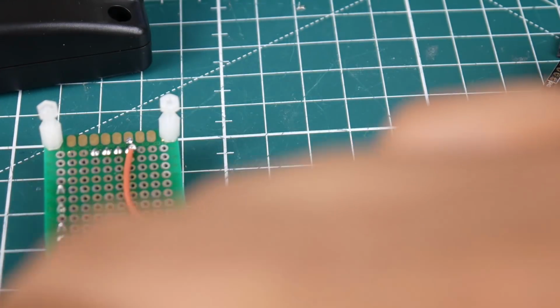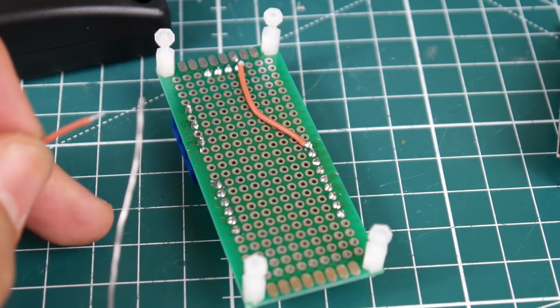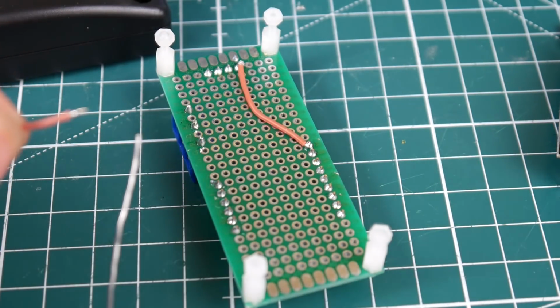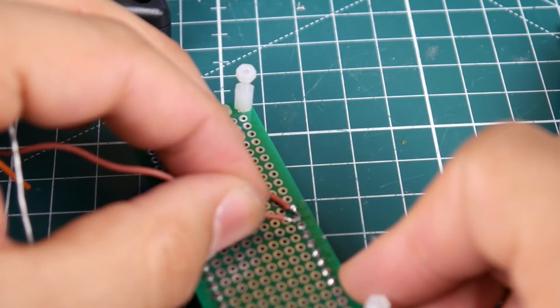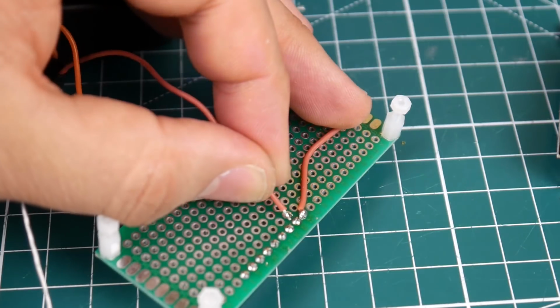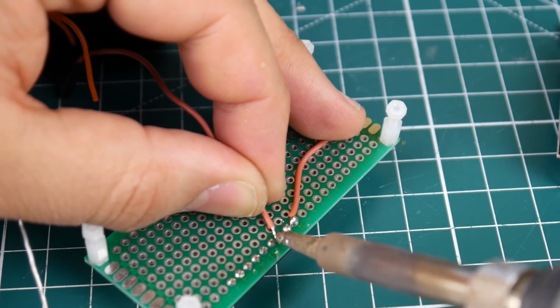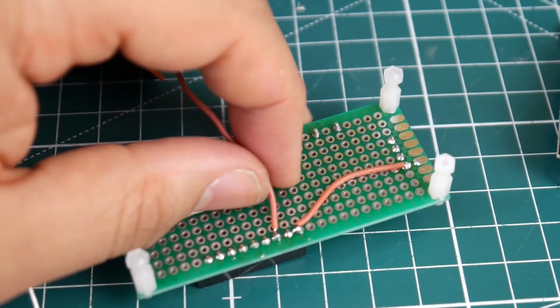So let's go ahead and get ourselves another wire. Alright, let's add some solder to this guy. Let's add a little bit more here. Okay, and we're going to trim him since he's a bit too long. We don't like long wires. So the 3rd one down, we said, was ground, so it's this one here. As you can see, it skips 1 and we go 1 down, that's ground. So let's heat these guys up. Alright, so that's the ground for our Fatshark.